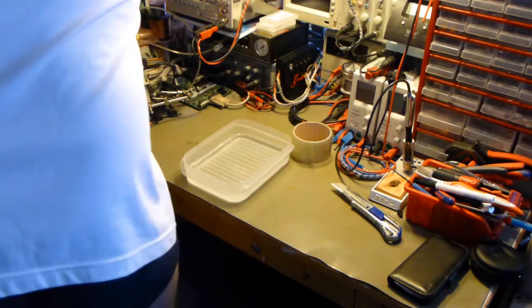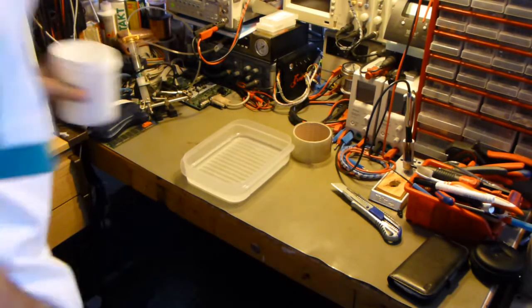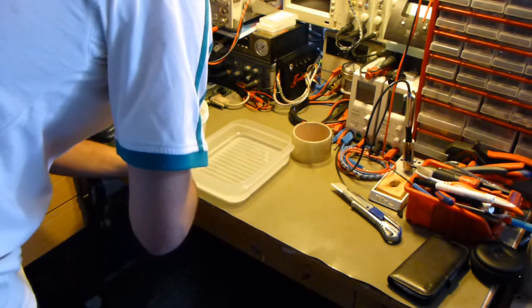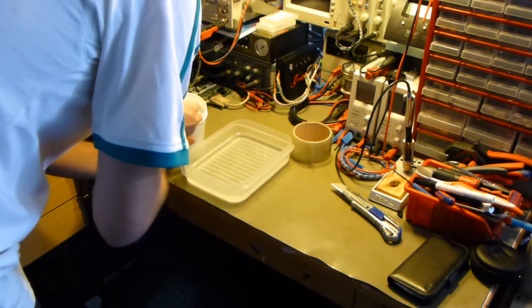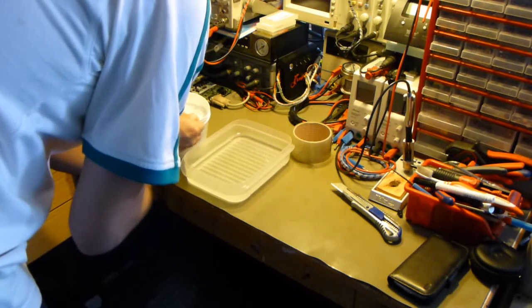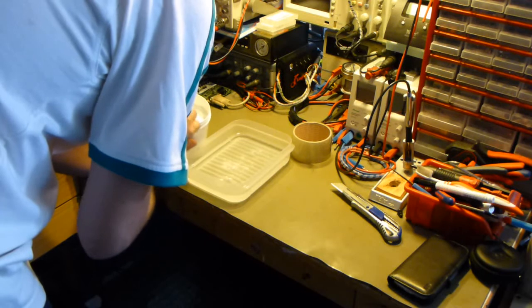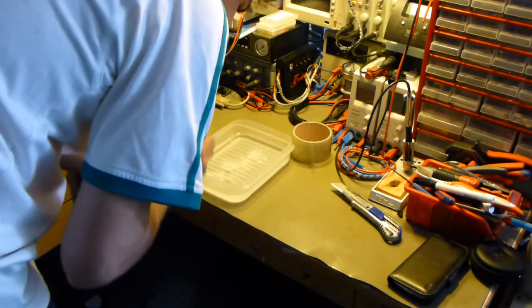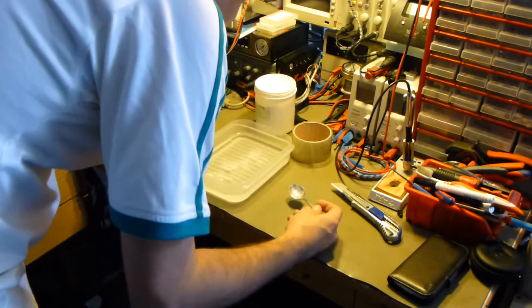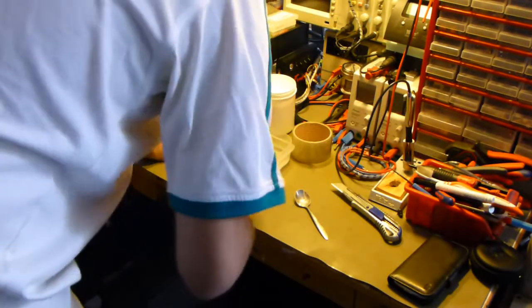And after you developed the resist, the next step then will be to harden it out. Half an hour under ultraviolet light from each side. It's, by the way, very powerful, and it gets very hot. I think it should already be enough. Let's try.